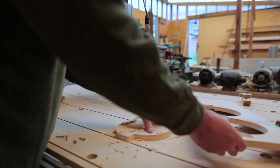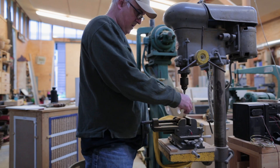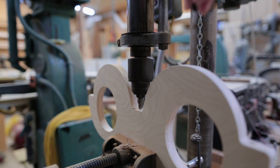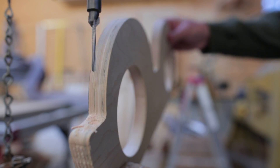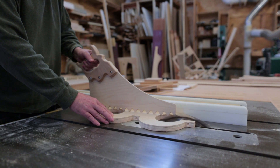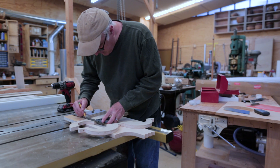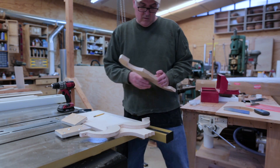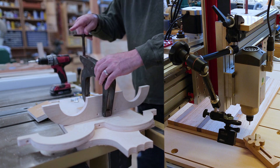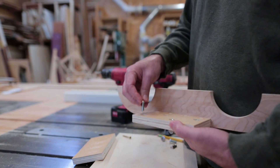The thought with the clamp was to make something that would go around the flexible hose but would be cut in half so I could put it around the hose and then screw it together, which would hold the hoses in place. So I cut out a shape and put holes into the edges. Then when I cut the piece lengthwise, I can screw it back together again with those holes. I need to mount it to the 80-20 piece that the spindle is mounted to, so I needed to add a little piece to let me do that. I had a little ledge attached here for a camera, and I took that piece to use for this — it had all the holes drilled in it for the screws that attach to the 80-20.